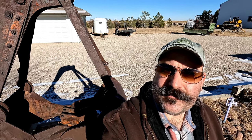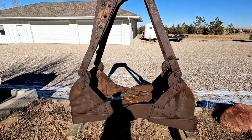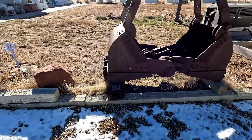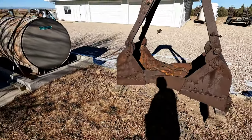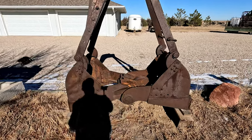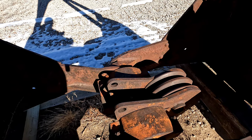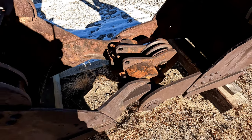Just thought I'd talk about buckets and attachments for the Bantam crane. Up front is the clamshell bucket — this thing is super heavy and that crane will barely handle it. They had this to unload coke, which was a hotter-burning form of coal used at the old foundry where they made manhole lids, well casing, you name it. The way it worked was two cables: one would actuate a pulley and pull these clams together like a cup, then work in reverse to dump it out.